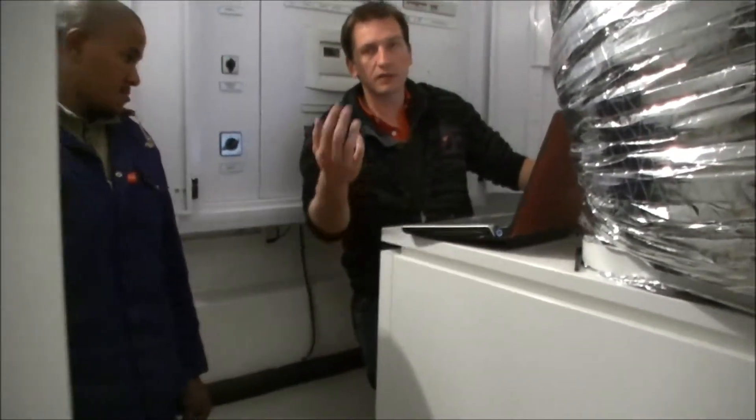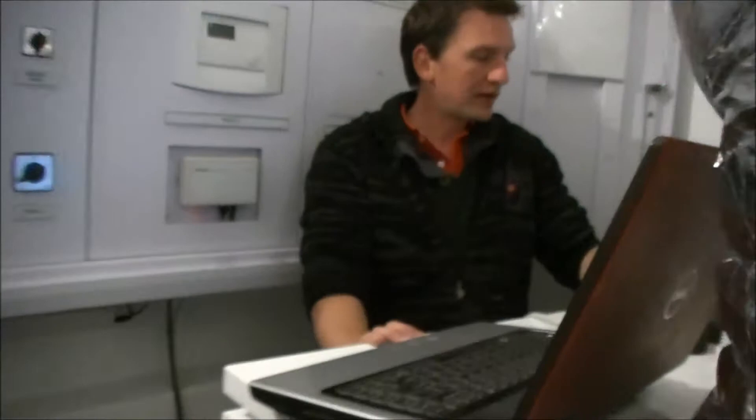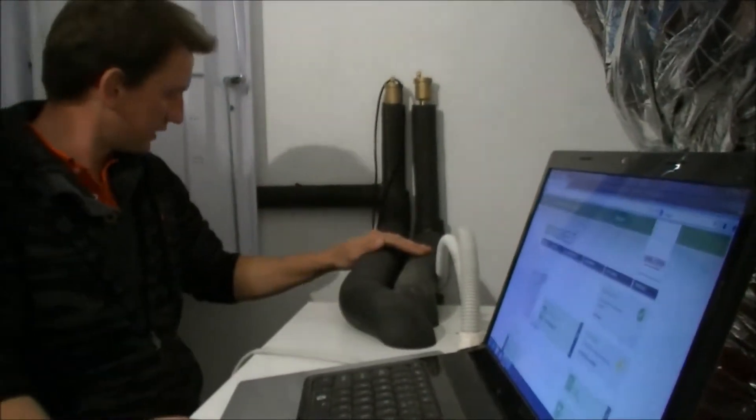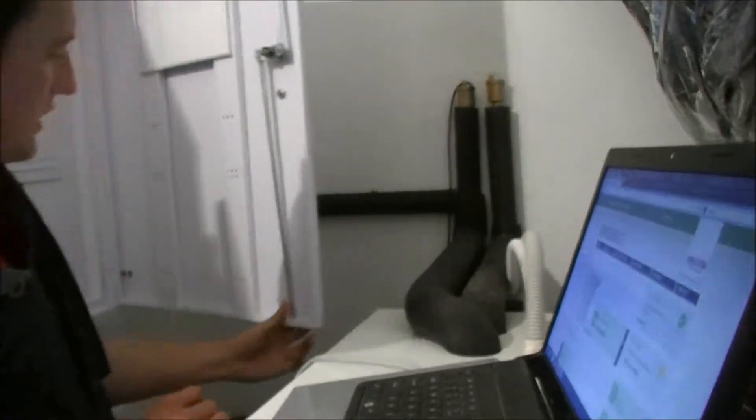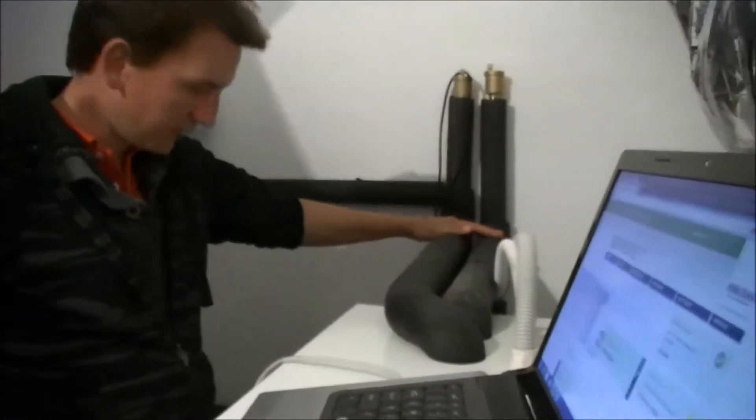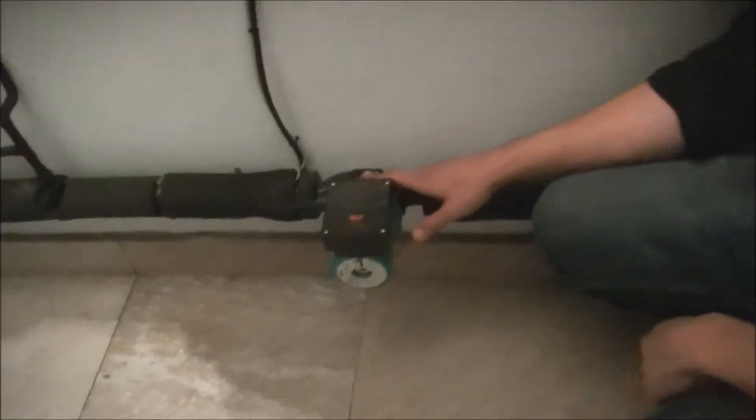These are the pipelines that Simon and Nyson installed with our aerators. On the other side here you can see your expansion tank. This is your closed loop circuit — the dead loop — where we're circulating dead water all the way. This is the circulation pump that actually circulates the water from the heat pump to the tanks.